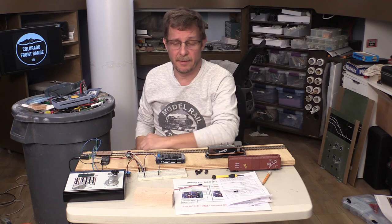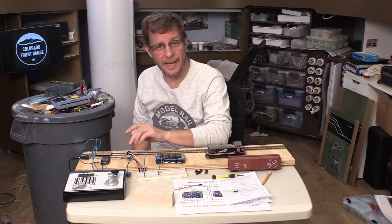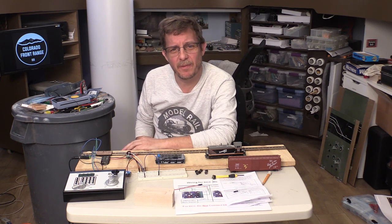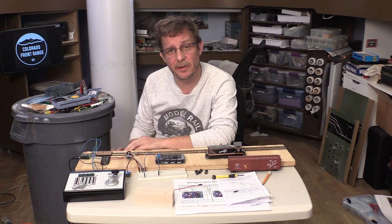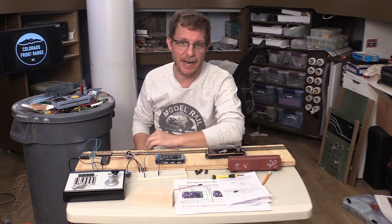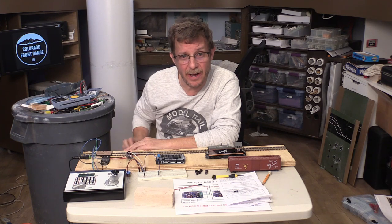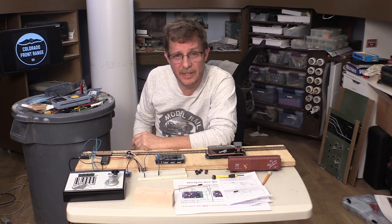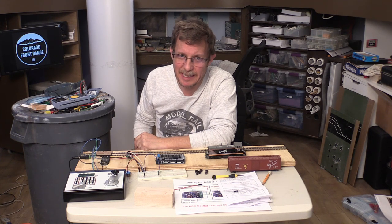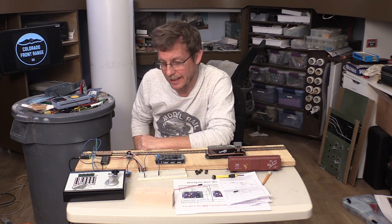Okay, so now we come to CT coils. And this particular version is from NCE. Now, the advantage of buying all these things and trying all the different CT coils and all the different sensor products is I have really been able to narrow down exactly what I want to do. The disadvantage of CT coils is if you're in DC, you can't use them. But if you're in DCC, you can. And this is really a very simple product to use from NCE.